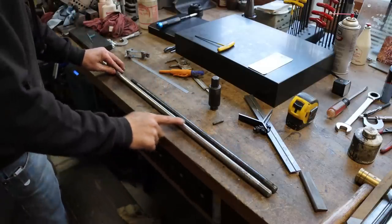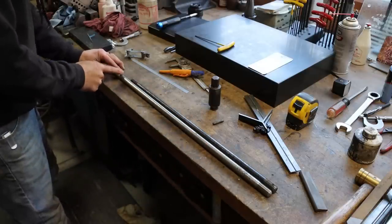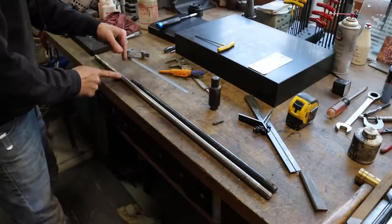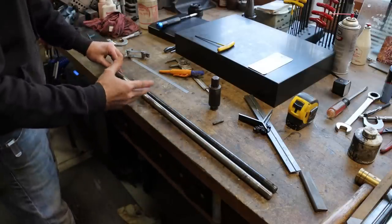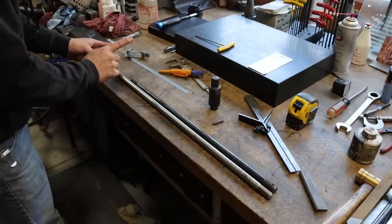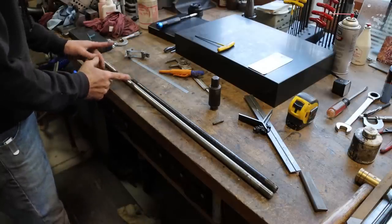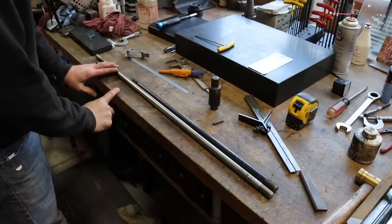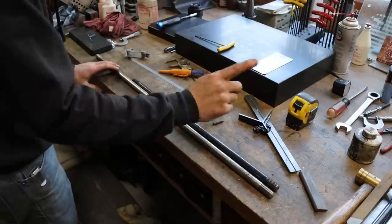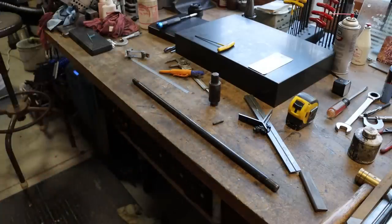But anyway, this is what we're gonna make our drawbar out of now, our new one, seeing as that Thompson shaft's not gonna work. So I've marked it out, about an inch, 200 thousandths longer than our old shaft. So let's take this to the saw, we'll cut it off, we'll go to the lathe, I'll show you me battling to get a thread in this, and then we'll move on to this piece after I show you the hardness tester on that Thompson shaft.